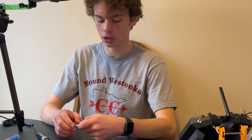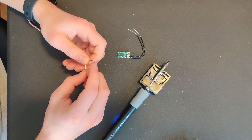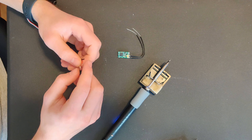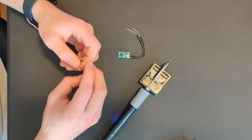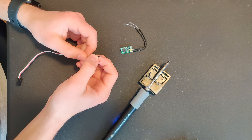To start flashing using the smart port method, there should be three different wires on the smart port of a FrSky radio: S port, 5 volts, and ground. These pins need to correspond to the pins on your XM+ or you will fry your receiver. In this video, we will be using white as S port, red as 5 volts, and black as ground.